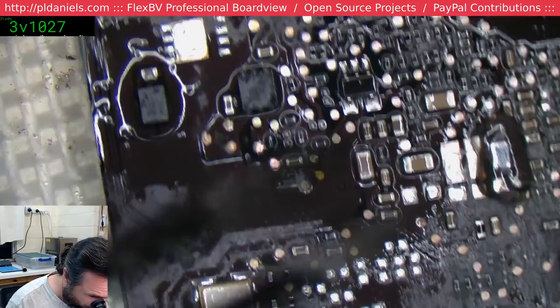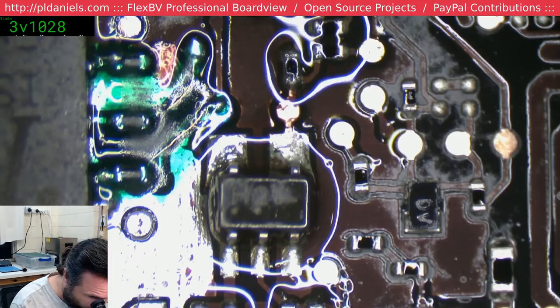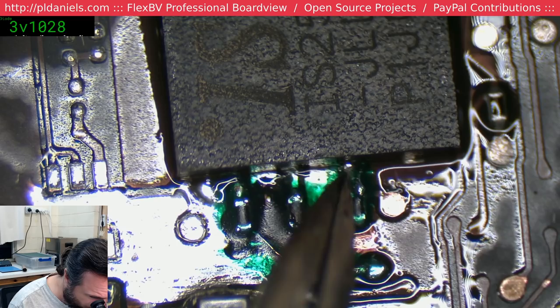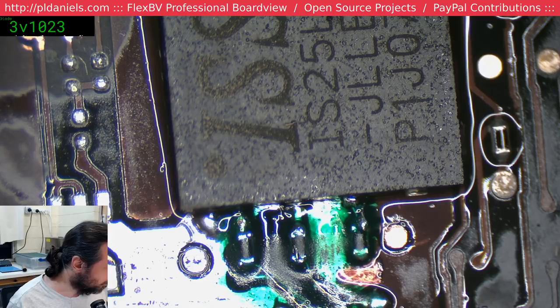This resistor here, I'm not overly worried about it. It does look a little bit sad, but it is more oxidization of the lead. Okay, this one here doesn't look like we've quite got enough solder in there. So I'll try and squeeze a fillet in. This one kind of pushed the ball out a bit much, which worries me. We'll try to get some solder in there. I'll probably use some paste